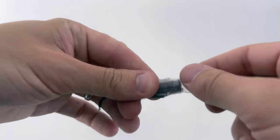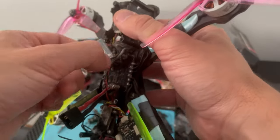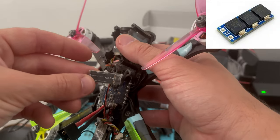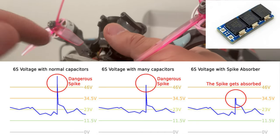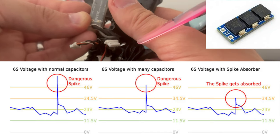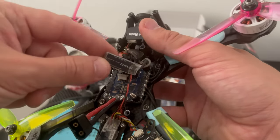I usually pinch it off and trim this a little bit so that you have enough tubing in between — just a small trim on those top leads to keep it nice and tidy. This is a Fetech product, but other companies make it too. It's called a spike absorber and uses TVS diodes to essentially cut off the voltage at a certain point. The capacitor smooths the electricity out; what this does is prevent anything above — I believe it's around 25 to 26 volts — from hitting your electronics. I'll put a link below so you can get it and see for yourself.